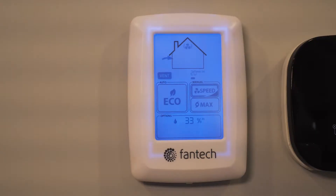The second and third ways are actually located at the main controller, which is beside the thermostat. The second way is to set the HRV to run automatically for a certain amount of time per hour. The third way is to run it based on the humidity levels in the home — once they exceed a certain level, it'll start to run. Make sure to set the humidifier 10% below this point so that they're not working against each other.